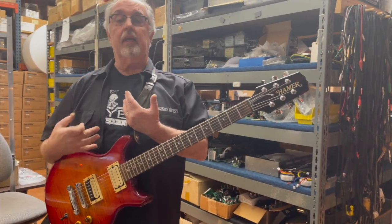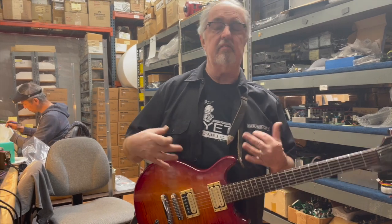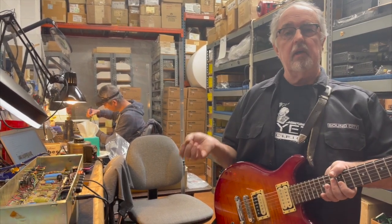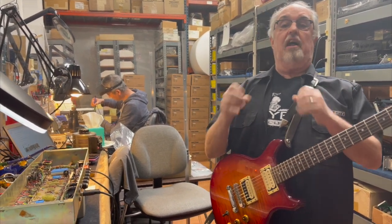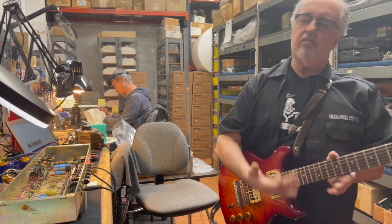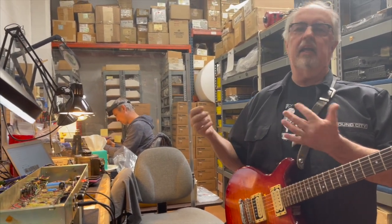And the other thing is when you turn the guitar volume down and play lightly, you really hear the clarity and the articulation that's the personality of the amp, because you're not pushing it hard enough to break up. So you've got just enough gain going into the amp so that it can amplify it without getting into too much distortion territory, and it sounds really clean, just on the edge of breakup. But if you back down the guitar volume a little more, it even cleans up a little more. And so that just gives you all this range on the guitar that you don't have with pulling tubes, variacing down, any of that kind of stuff.